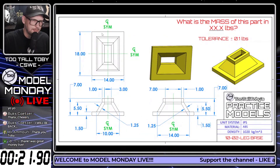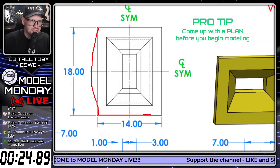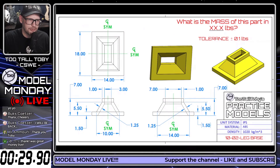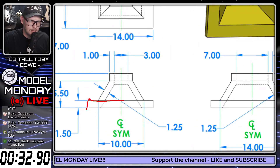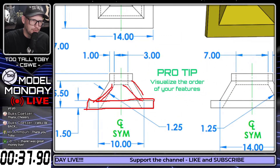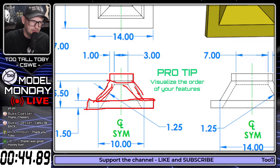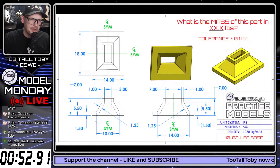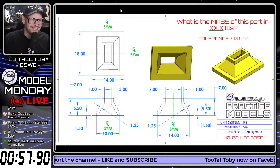We think: starting plane, starting profile — top plane. We create this shape as our starting profile at the origin, bring it up to a height of 1.5, then figure out how to create the rest of the geometry. It's almost like it could be an extrusion, or maybe a loft between these two to create that transition up to the upper shape. Then all we'd need to do is get rid of the interior geometry — looks pretty easy.